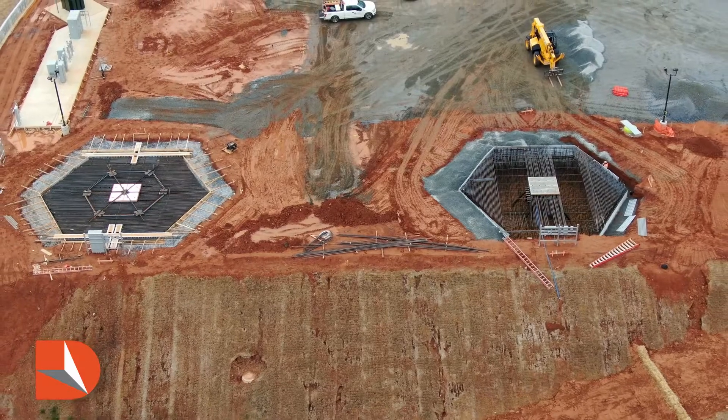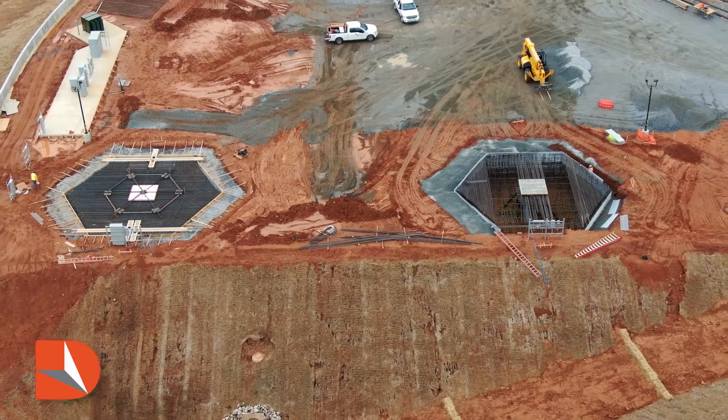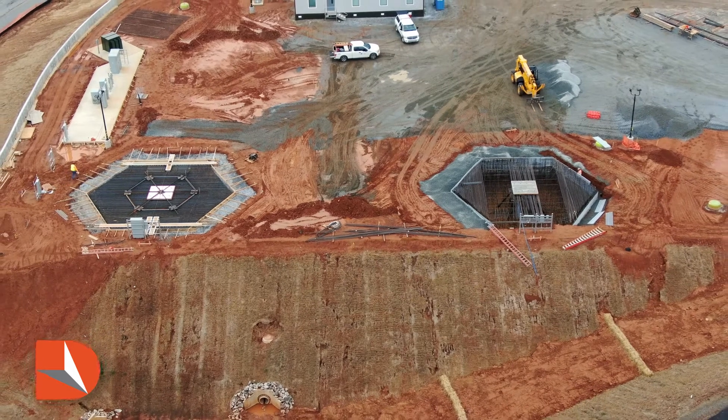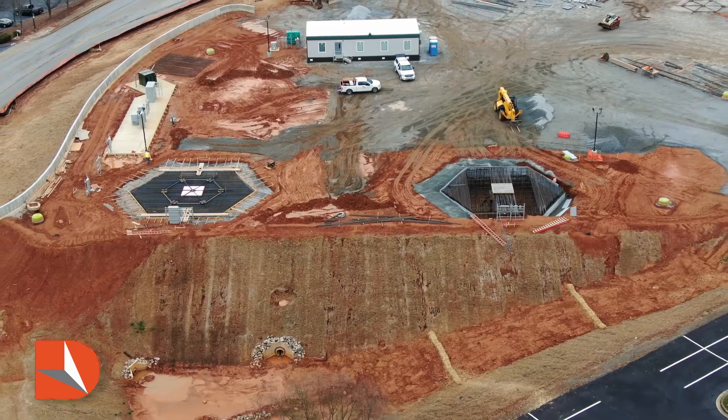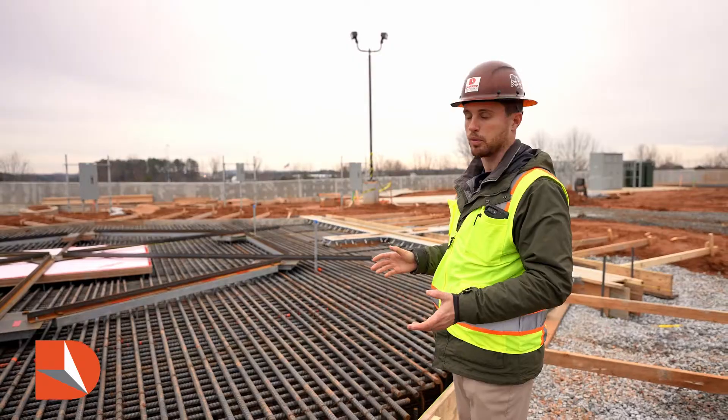These foundations are 48 feet 6 inches wide by 42 feet long. 10 feet is our depth, which will be filled with 564 yards of concrete supported with a number 10 rebar structural support system.